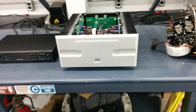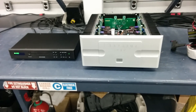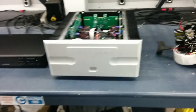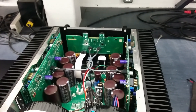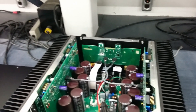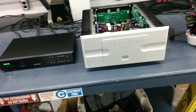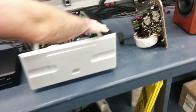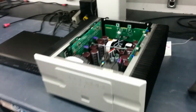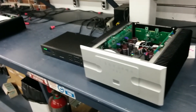Oh my god, people buy that. You can run that in mono? No, this is a stereo. The reason being is because it's already 4 channels. Channels 1 and 2 are mono'd together to give you a large output, like a 7p. Oh, these are two channels put together? Yep. That's how the 7p works — the 14p doubles the power, and a 28p is two double-sized channels combined. And then you have to buy two of those. So if you're buying that, you're going to be spending quite a bit.